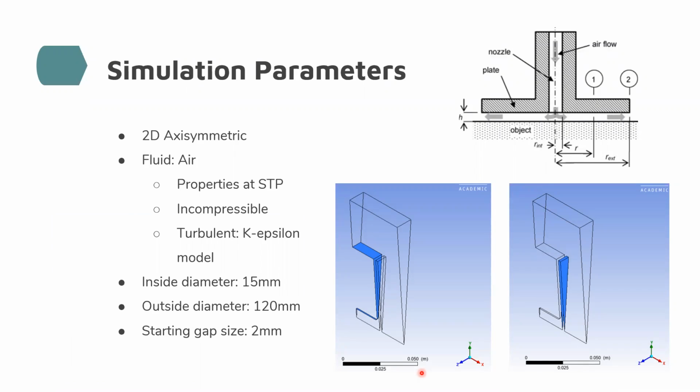So how we did the simulation in Ansys: the x-axis is how you have to do axisymmetric simulations. If you can visualize this here, the substrate is highlighted here, and then the gripper is highlighted here, and the enclosed volume is just the air. All of these parameters are picked specifically so that we could later do a simulation using a CD as the object that we were picking up, and another CD as the top plate. So all of these dimensions are not totally arbitrary.